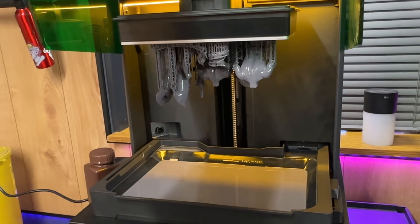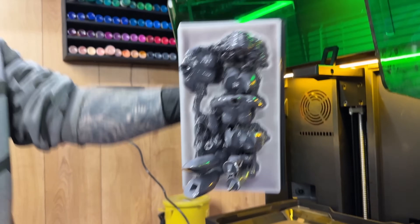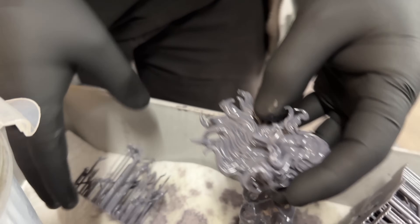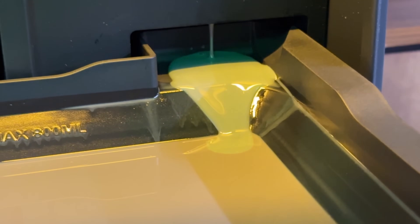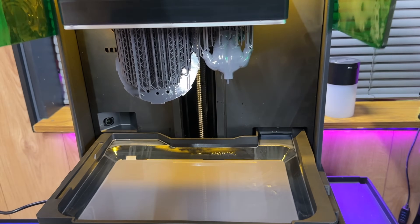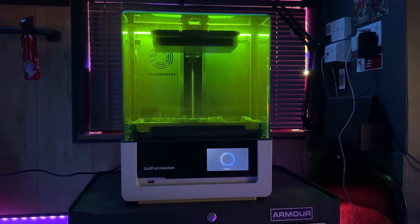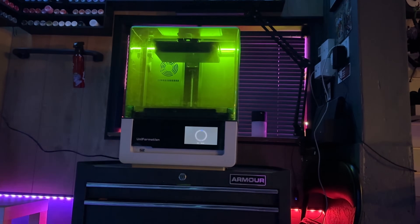There are some differences between the GK3 and the GK3 Pro. The main difference is the light source — the GK3 has a 405 nanometer light source and the GK3 Pro has a 385 nanometer light source. This ultimately means it's more useful for transparent resins and some specialist resins but not really for much else. You might notice a slightly longer layer cure time, but unless you're printing in clear all the time, it might not make a difference.